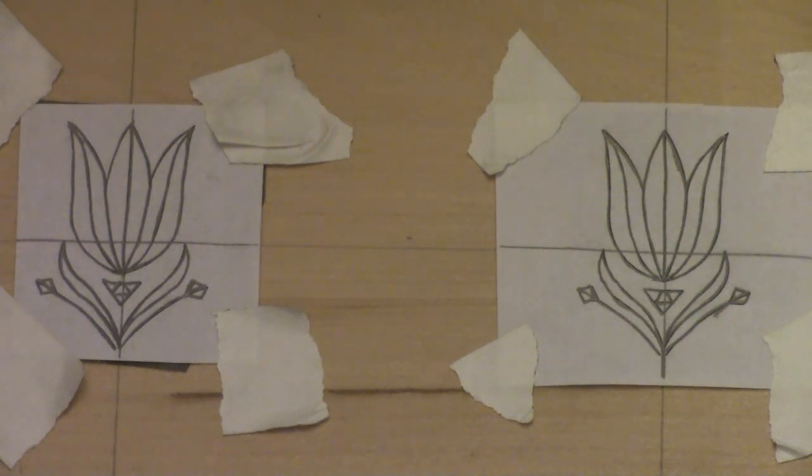You don't want to use carbon paper because it leaves a residue that you can't erase. You'll get an absolutely beautiful transfer with incredibly dark lines using it, but it's next to impossible to remove residual markings that you didn't carve out, and that can lead you to inadvertently damage your project trying to remove them. Sometimes you may be tempted to use sandpaper, which can also embed this in the lines into the wood, and it takes away that crispness or the sharp edges of your carving, so I recommend not doing that either.